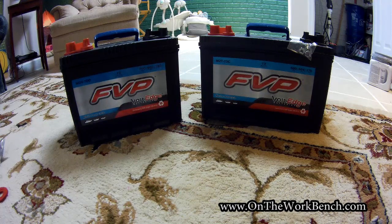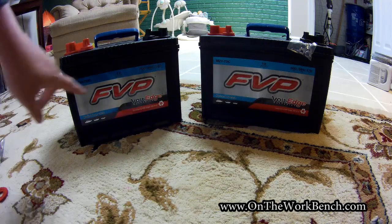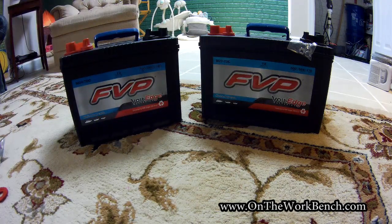One quick change I want to point out: I actually switched from the batteries you're going to see through the next little bit of the video to these deep cycle marine batteries. The batteries I first showed you were not deep cycle — they were just regular marine batteries. They were AGM, which I actually prefer over these standard type batteries. But you need to have deep cycle batteries because they'll actually provide a better, longer charge. You can run them all the way down and bring them back to life, unlike a regular battery. With a regular battery you can only use about the first 20% or so, and then it won't have the amps to deliver the energy you need to power your pump.